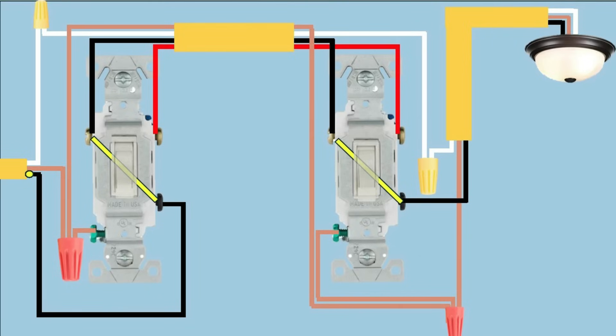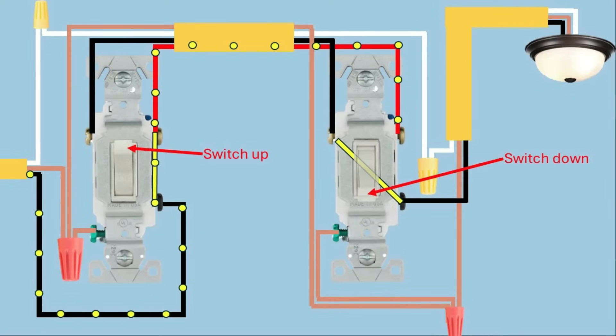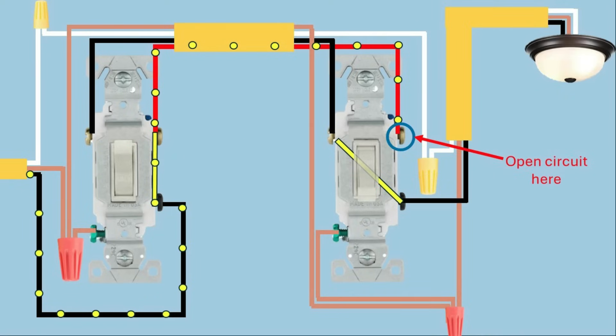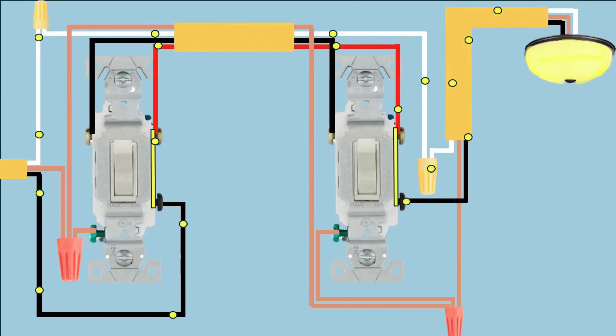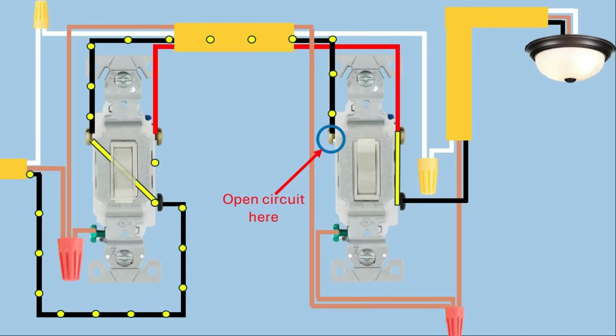Now that we've got this circuit all wired together, let's give it some power and turn that light on. You can see how electricity flows from the wire coming in, across the first switch to the second switch, over to the light, and then back through the switches and back out to the main. When we toggle the left-hand switch, the circuit is now open — electricity stops flowing and the light goes off, because the electricity can't flow past that second switch. Toggling the right-hand switch puts them both in the up position and electricity starts flowing again. Toggling the left-hand switch again puts it in the down position and electricity stops flowing again. That's how these three-way switches work together to turn the light on and off.